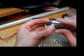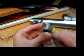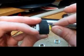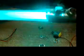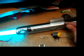A couple of things I didn't list which I'm actually going to include: I had bought this for this lightsaber and never got around to putting it in. This is a vibrating sensor. The wire came off — I'll solder it back on, black is negative, red is positive. Once this is hooked up inside of it, every time you come in contact with something on the lightsaber — every time you go and smack something with it — this is going to cause your lightsaber to vibrate all the way through.